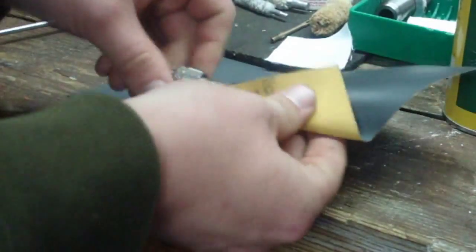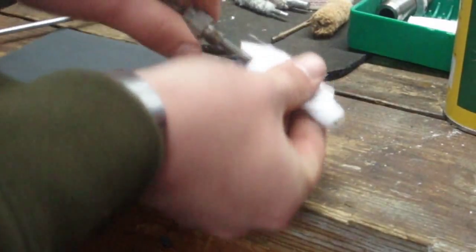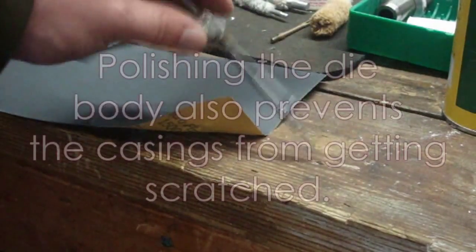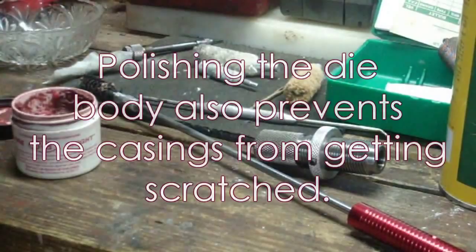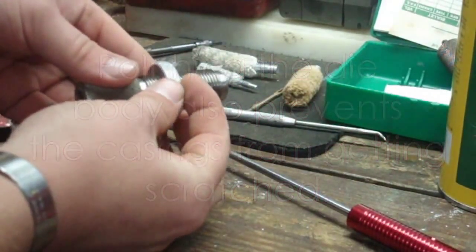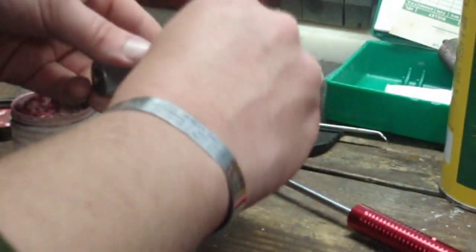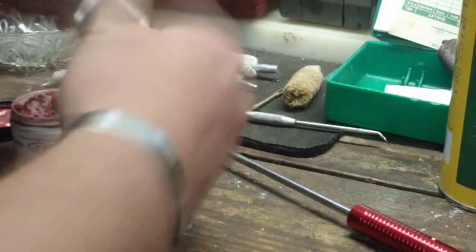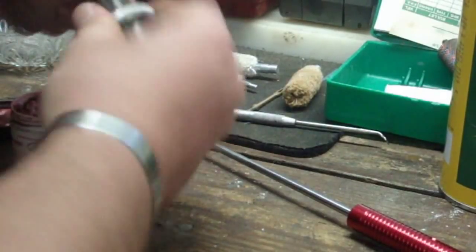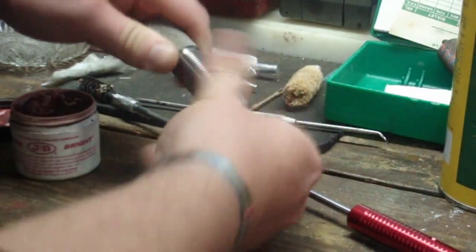There's not really a whole lot to it — we're just improving the function of the dies and removing any preemptive dirt, debris, or anything that would cause the cartridge to get stuck. Moving on to the die body: every brand is different, but on the RCBS you're going to have this little allen locking piece. Go ahead and loosen it up — don't pull it out all the way, leave it a couple of turns in. Then go ahead and take the lock ring off the die.